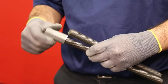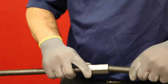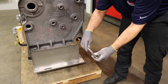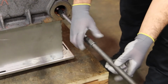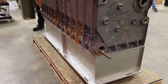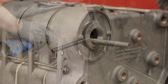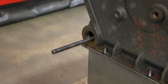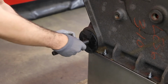Assemble the draw rods by connecting the 11-inch rods together with coupling nuts. Each of the two draw rod assemblies should pass completely through the upper and lower nipple ports of both of the section assemblies. For ease of assembly, lightly lubricate the threads on the draw rods with spray-on dry lubricant. Place the draw plates, washers, and nuts on both ends of each of the draw rods.